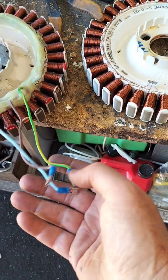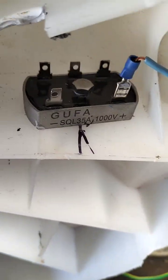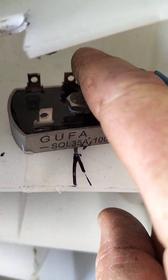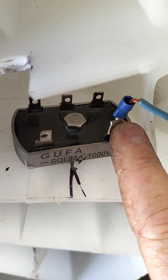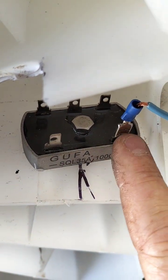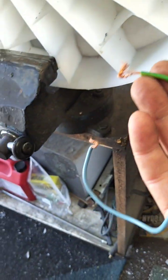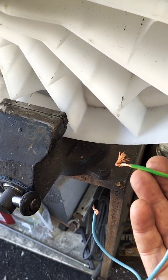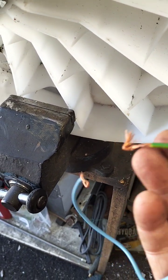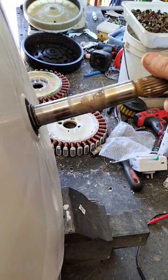When you take these three phases here, it comes out as three-phase AC. We'll put it through a bridge rectifier — the three back ones are the three phases — and that bridge rectifier will convert it to two outlets, positive and negative, at 12 volts. So we'll end up with only two wires and DC current, not AC, not alternating current — direct current. That's what we want: to charge batteries utilizing this thing spinning with the wind generator driving it.